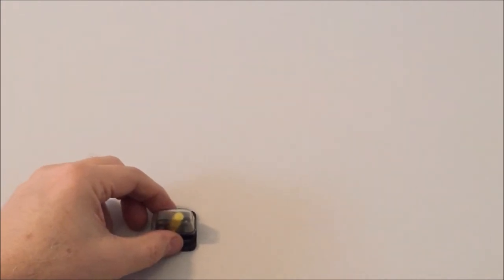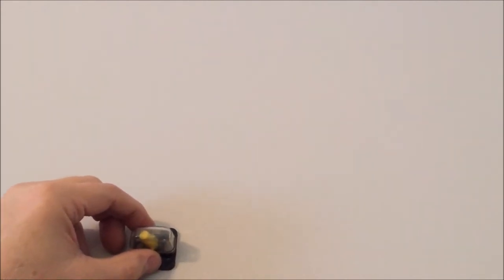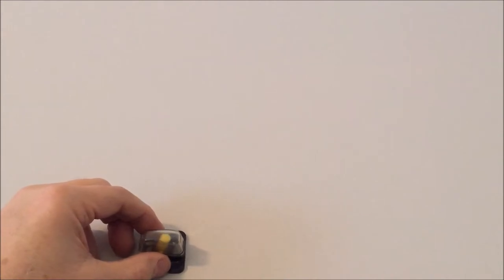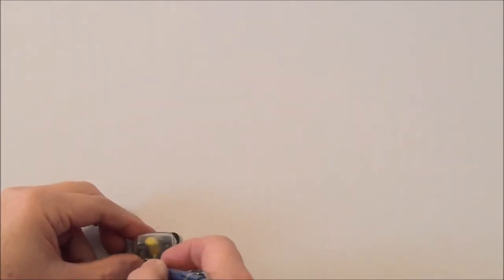Let me show you. Okay, after you've narrowed down the vertical with knocking, and then you come up with magnetic stud finders, they are my favorite. See there? I like the way that they operate because I can go back and forth and pinpoint exactly where that thing is. It's right there. So then that will tell you where the stud is, and I made the smallest mark that I can erase, actually making more of a black mark scuffing this thing on here.